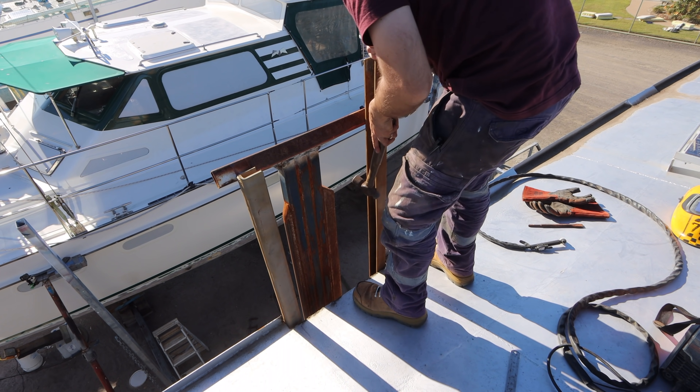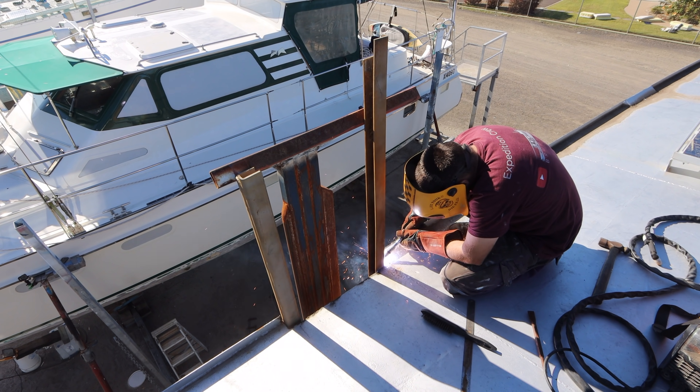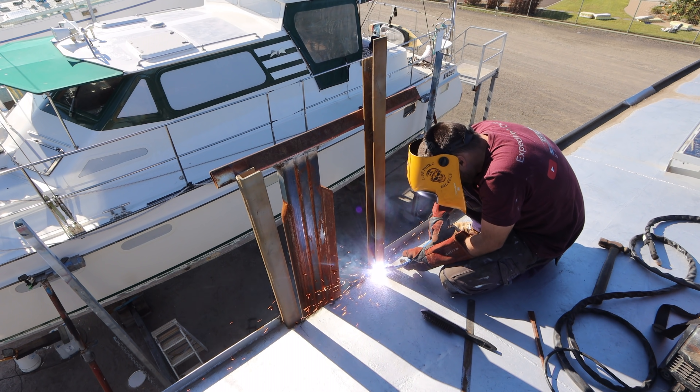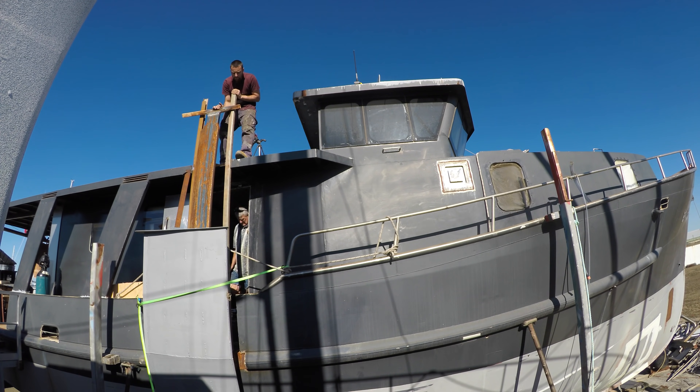We bop the slider back — there we go, consider it bopped. With that back slider tacked in, we can now measure what our distance at the very bottom is between the two sliders, then bring that up and do the equivalent measurement at the top and weld them in. Once that's done, we can start putting the pins that act as the guides on the arms. For now we've just got a manky old bit of rusty steel on there just to make sure it slides, but we're getting pretty close to having this a fully functional slider.